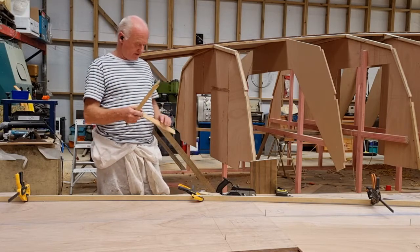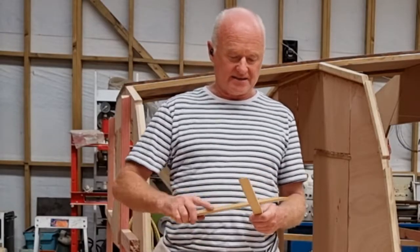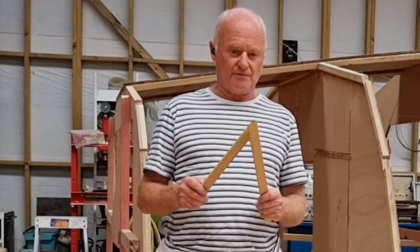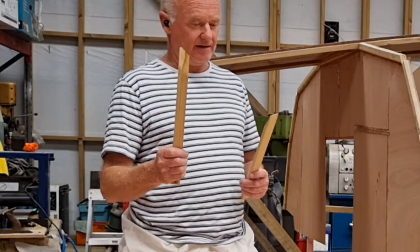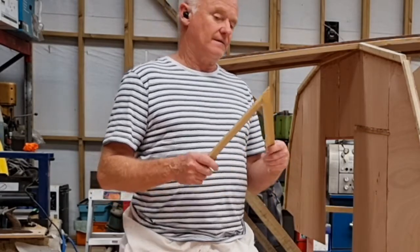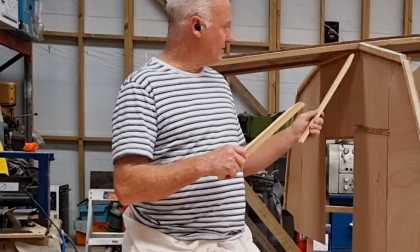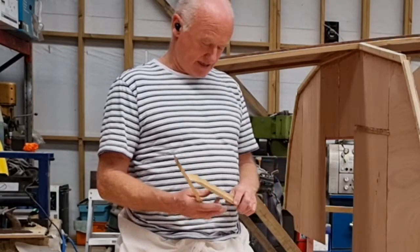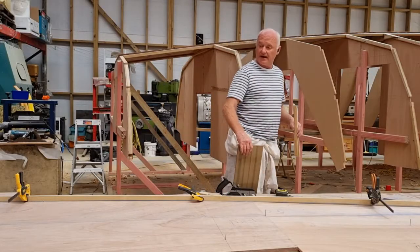A few tips — glue sticks. I like to make up a couple of glue sticks. These are made out of softwood but hardwood is even better. They actually get better over time because once they get infused with resin you just tickle them up on the bench. I have an angled one and a flat one — they're good for mixing, for applying, and for cleaning off the glue. This angled one is really good because it gets in the corners between the stringers and the ply so you can get all that glue out and clean it off nicely. That's what we call sheathing the outside of the boat.